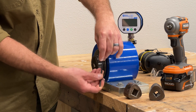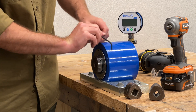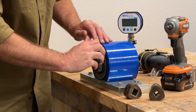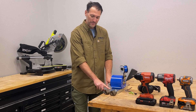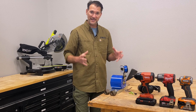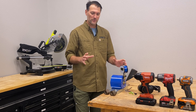It is going to feel a little sticky, but keep turning it and you will feel it seat. Please don't use a power tool to do this — it's really easy to over-torque this thing. Even though it's not as expensive as some torque testers out there, you did pay good money for it. There is also a steel mounting plate available from Inertia Torque — we suggest you get it, especially if you need to install onto wood like we did. It gives you a nice, stable, solid platform so that what you've attached it to isn't absorbing the torque.